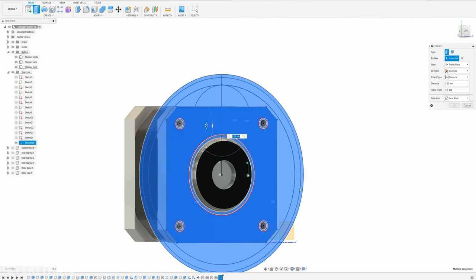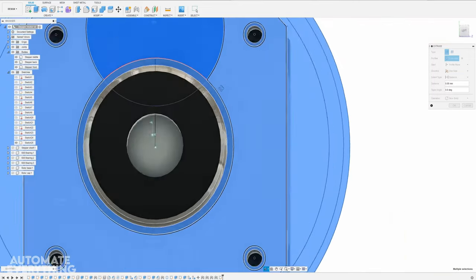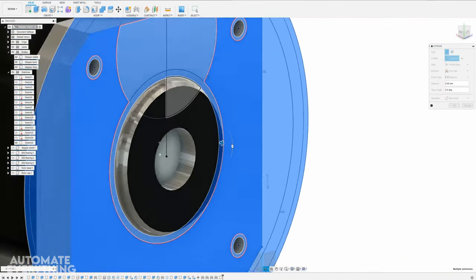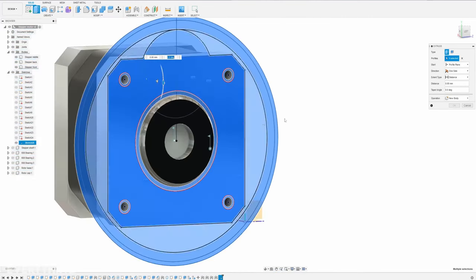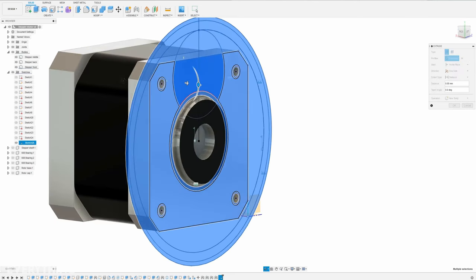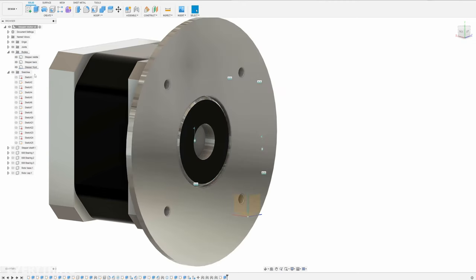We can only create one offset, so let's draw a line to the top — the space is 1.3mm — and set the wall thickness to 2mm. Draw a circle to that line. Now you can see a bit of the shape of the body of the pump. Let's extrude it, selecting every part we want extruded. We need to think about thickness — there's a screw here, and with it fully inserted let's give it 2mm thick. Then draw a sketch, measure the bolt head circumference at 5.5mm, make it 5.6mm, and extrude 3mm thick for the bolt head recess.